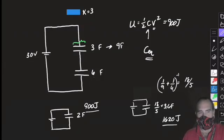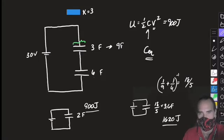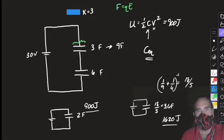Now, when you start putting that dielectric in the field, you are also at the same time changing the field. You're making it larger. This is pulling charges out of the battery in order to respond to the fact that your capacitor is increasing its capacitance and can hold more charges. But the force, the reason why you have to push, comes right back down to F equals Q times E. The electric field that's already established there is applying a force to the charged particles in the dielectric. You are having to overcome that force.